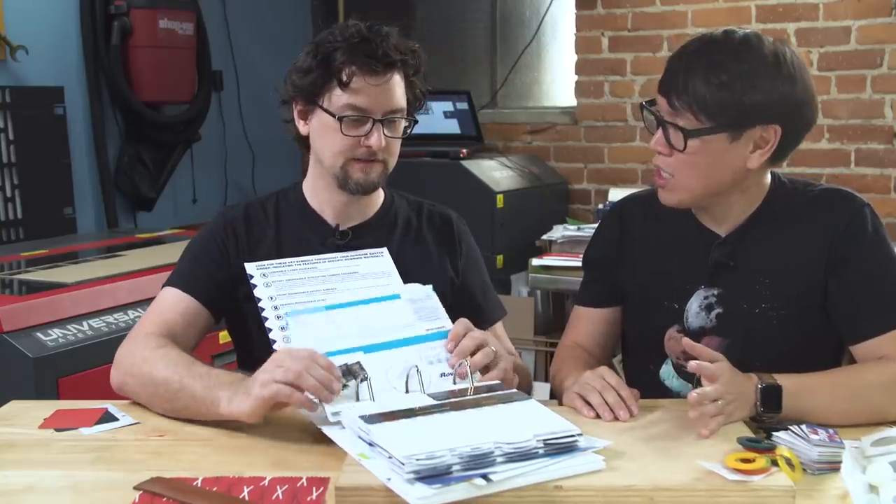Now, are there lifespans to some of these samples? For paint swatches, they're going to fade over time — they recommend you get a new one after a couple of years. Be mindful of things that have a lifespan, especially things like 3D prints — if it's a resin, the color might change over time. A good example are rubbers and plastics: if you let them sit out, they will harden and become brittle. So if you've had your rubber sample pack for 20 years, you may want to swap that out, store them properly, or use an actual durometer to double-check them. It never hurts to contact manufacturers and ask for a clip or look for samplers. McMaster-Carr is a really good place for hardware samplers, and it can save you a lot of time and money. If you have a workshop and collect sample packs of your own, we'd love to know what you collect — please post them in the comments below so we can add more to our sample collection. Thanks for watching, we'll see you next time.